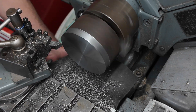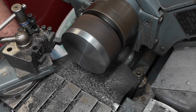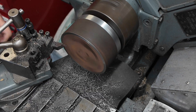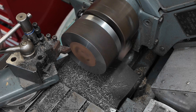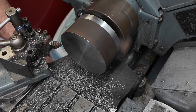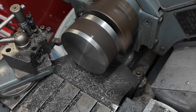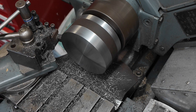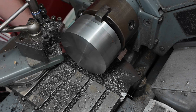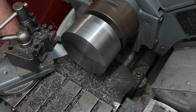I'm getting a pretty good surface finish here, just cleaning up the edge, making sure it's nice and smooth. Very nice finish - this cast iron is really good. We've flipped it over and we're doing the other side, just getting it to shape before I part off a chunk, just a bit bigger than what I need to make the gear. Clean it all up while I'm here, then get the parting tool in and slice off a piece.